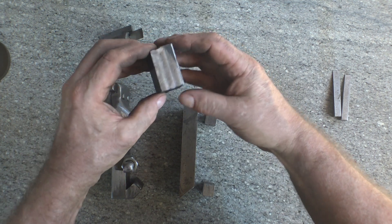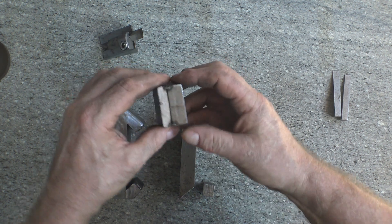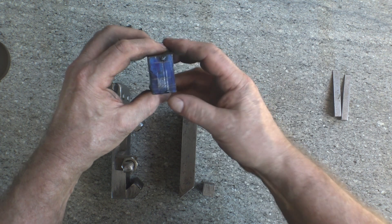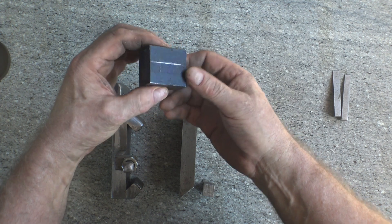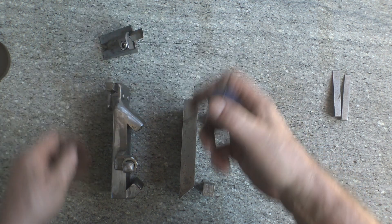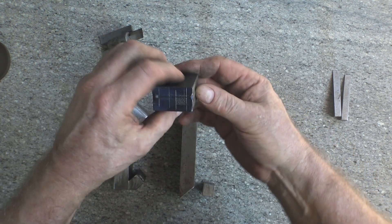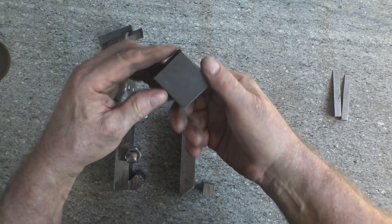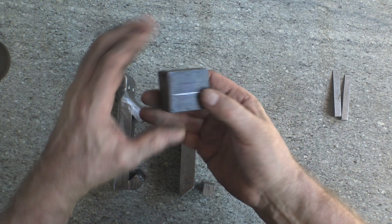To make the tool holder I have two blocks of mild steel — one of which is 15 millimeters, the other is 10. I have a fabrication background, so I will weld everything. These two blocks will need drilling, tapping, and countersinking so that they will make up this tool holder. My usual reaction to that sort of situation is to tackle four corners, drill and tap, and when I finish with them, mill the sides straight.